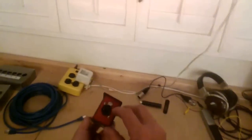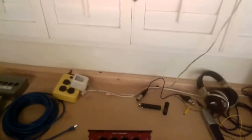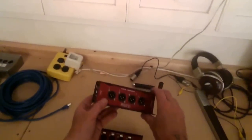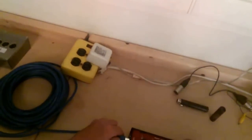The other unit I want to show you is the Cat Snake. The Cat Snake is Cat5-based and runs on EtherCon shielded Cat5 cable. It's got metal sides on it and runs four analog lines on a Cat5, Cat6, or Cat5e cable. It's got an input and an output, and basically everything's in parallel, so let's go ahead and try that out.